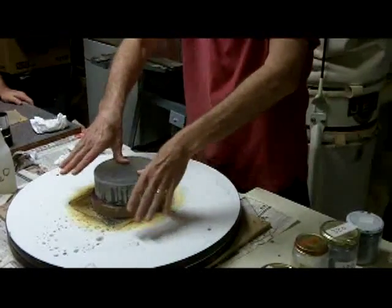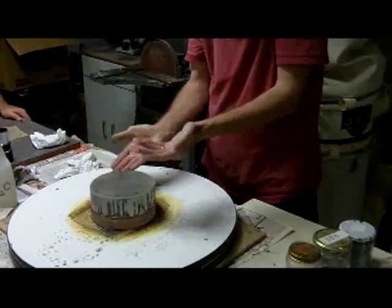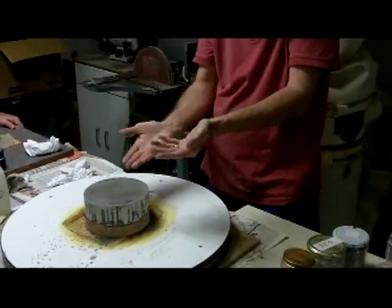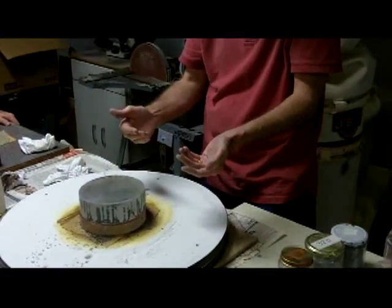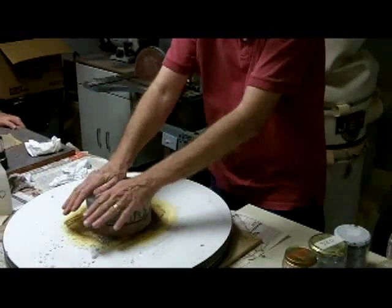And here you want to keep weight down, press as hard as you can, and like I said before, on this stroke, every 15 minutes or so, you'll turn them all over. You put the tool on the bottom and the mirror on top. If you don't, you'll be sorry, because you'll change the F ratio. You'll wind up with a really short scope or a really long one, and you'd rather keep it the same size.